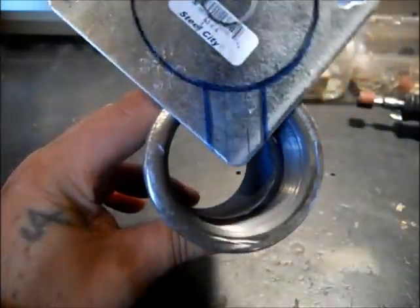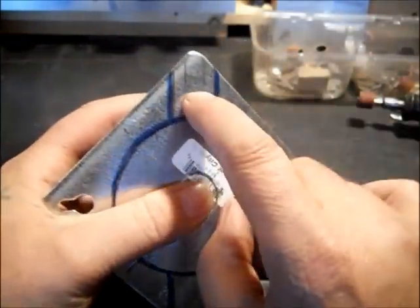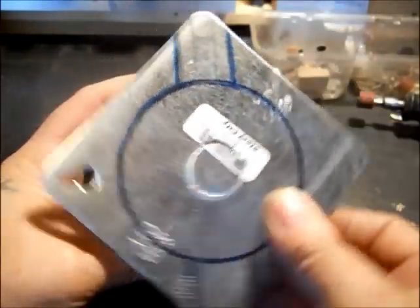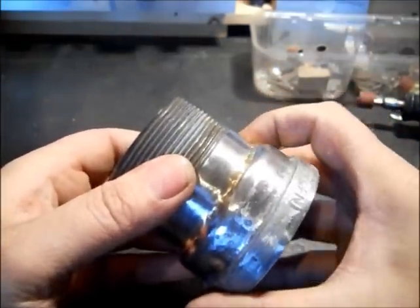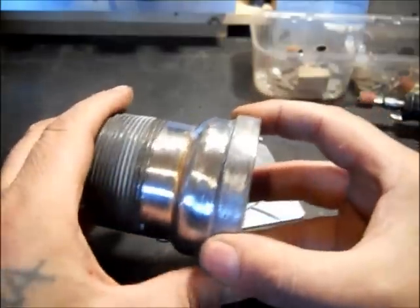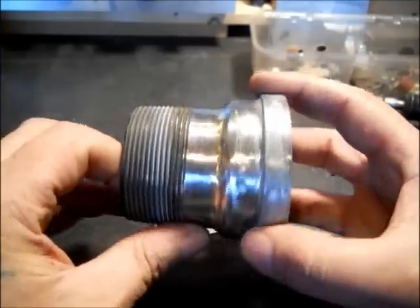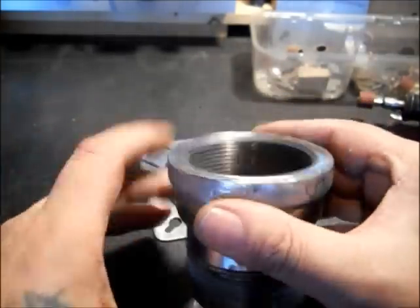It's going to act like a big choke plate with an arrow in it — it will swing. Make sure you have whatever you mount up high enough so when you swing it all the way open, you're getting a hole open as far as you can. It will be self-explanatory when I'm done. Normally I wouldn't have done this good a job — I might just weld it with a little 1/16 inch rod in my mini welder. I just wanted to show how nice you can make this look. You could also heat this back up with a torch and put some black carbon on it if you don't want to paint it. This may just be heated up and put some carbon over top of it, or spray paint — the black barbecue paint. It's not on the hottest part of the stove.